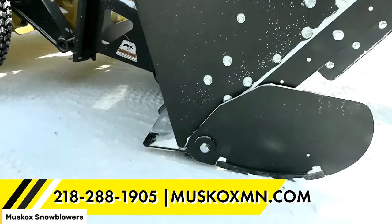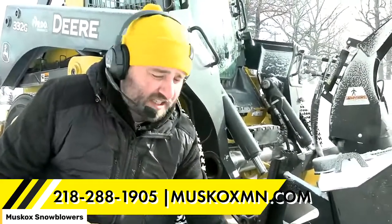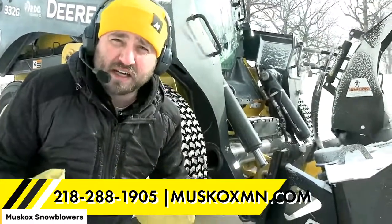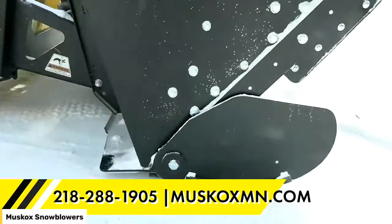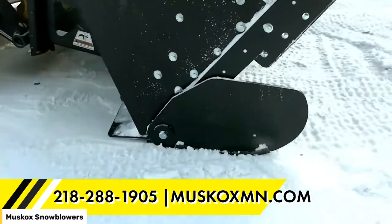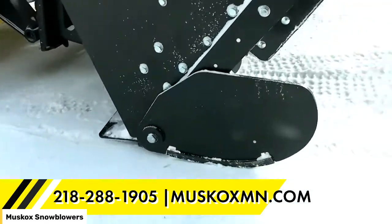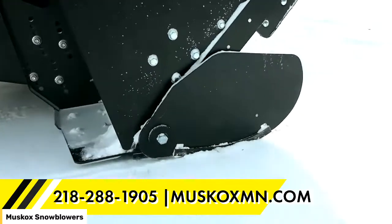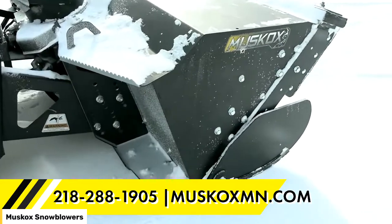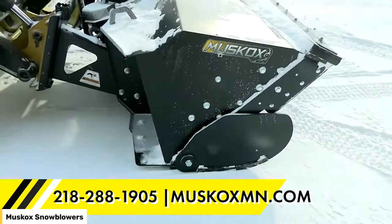So what we'll do now with Peter's camera is we'll just watch Ron as he goes in the forward position, and you guys will see how we ride on the glide plate, and I will get into how we can ride on the steel cutting edge when you want. So let's go ahead and watch that, riding on its surface. On that 585 square inches of that glide plate, you guys can see a little bit of a white on the bottom. We do have UHMW plastic that we're riding on the edges right now, so we're not scratching the surface if we're on any type of concrete, but that gives you guys a chance to see that.